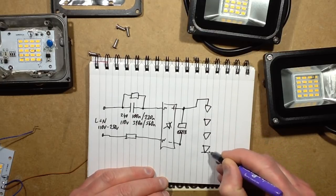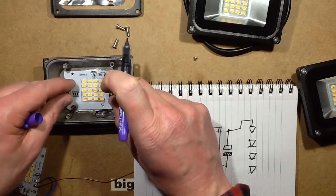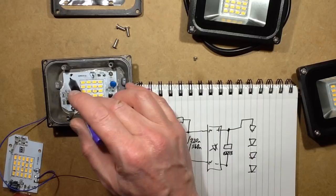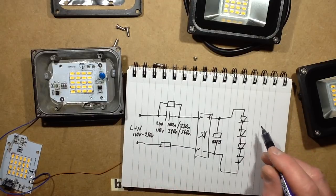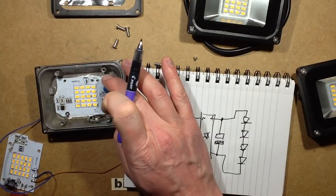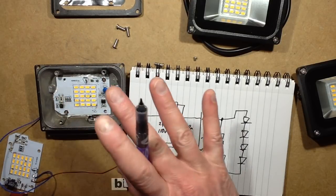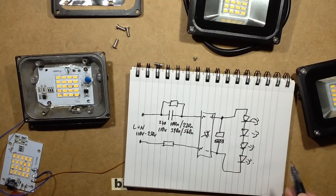I'm not sure how many LEDs I'm going to be able to fit in. I'm not going to use the reflector - I'm just going to fit as many as I can fit comfortably while leaving good margin of clearance to the mountings and also leaving generous room for the circuitry. It's going to be just a wee bit wider but about the same height as this array. I'll also allow an earth connection - I'll see if I can add a little earth connection on the PCB, or it could just be put on to one of the mounting positions. I'll also fix one of the more significant problems: their hole spacing is not correct for the housing, so they're only mounting the circuit board diagonally with two fixings, and that may be causing distortion and limiting its ability to couple the heat out.